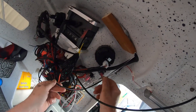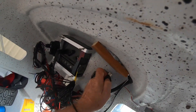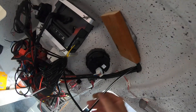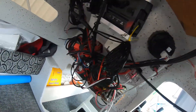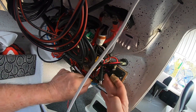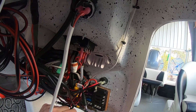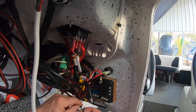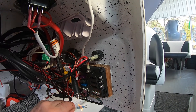This is the NMEA cable, and as you can see, I've got enough sticking out there to go to the Raymarine unit, but it's not going to reach over to this bus. So what I need to do is move this bus onto this pad here so I can plug it up. I've got the thing back to front actually — it's got to go that way so that the screw-on end goes onto the Raymarine, and that end goes into the bus. I just had to put a new end on this — the previous one was too big for where it needed to fit. I also had to split this wire to give myself more room to fit the separated attachments, because they only left a tiny bit of wire hanging out. I've put a bit of heat shrink on there as well.